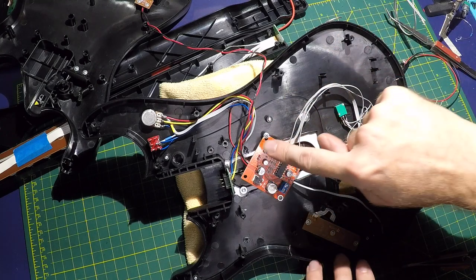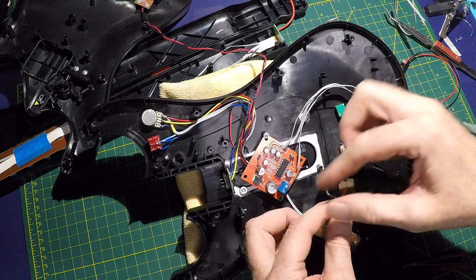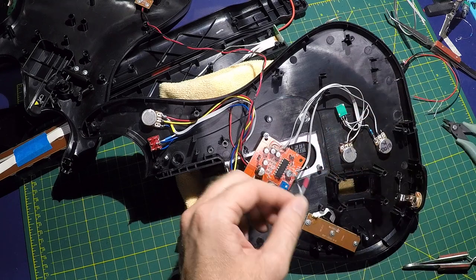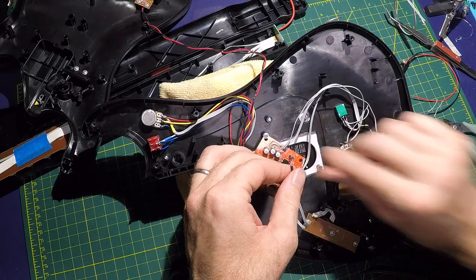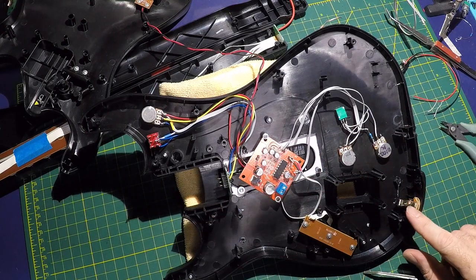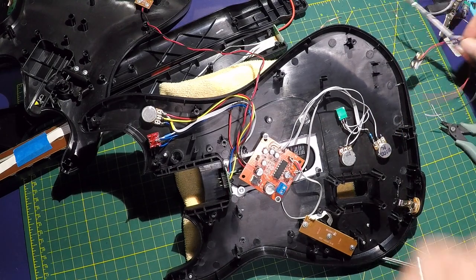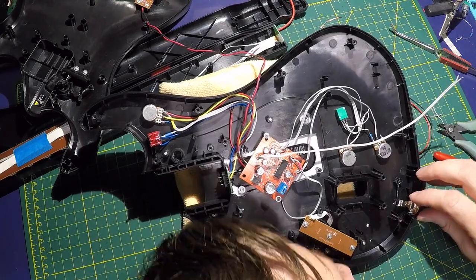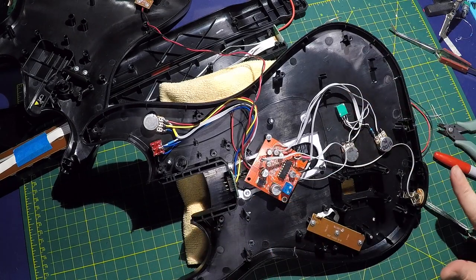Now we're going to wire in the input from the cassette player. That was this one that I previously ID'd with this heat shrink. So that's going to come into the input here, the red on the positive, black on the negative. That's why I previously ID'd these, so I can easily figure this out right now. So next, we'll connect up our output to the quarter inch. I already have a wire prepped right here. Okay, that looks like that's all good there.